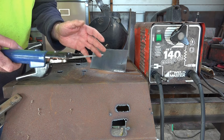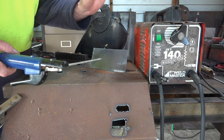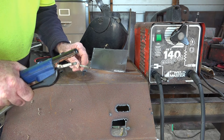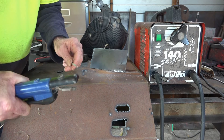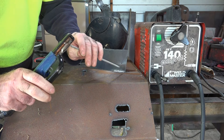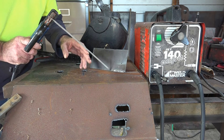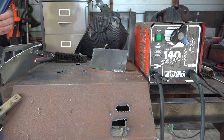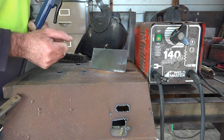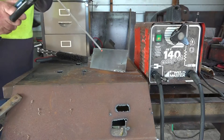Instead of that huge roll of welding wire for the gasless MIG, all you've got here is an electrode from the box - cheapest chips about 20 bucks for about 50 electrodes. You open up your electrode holder and you can see it's got grooves in it - you just put the electrode in whichever groove feels more comfortable. Always remember we're dragging these electrodes to get them started, so make sure they're gripped tight. All that's in this old welder basically is one transformer and a couple of switches - can't go wrong.